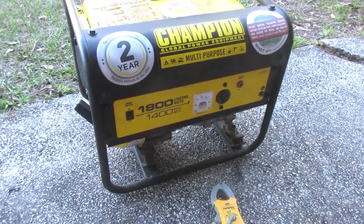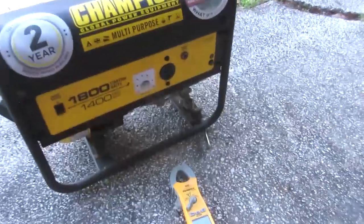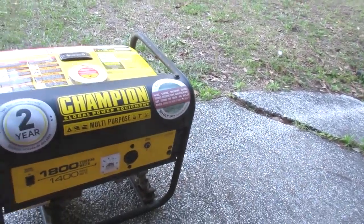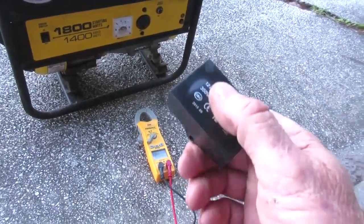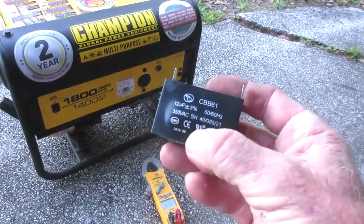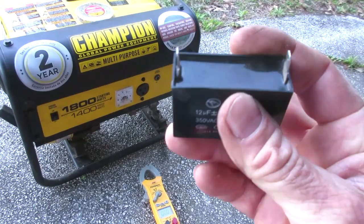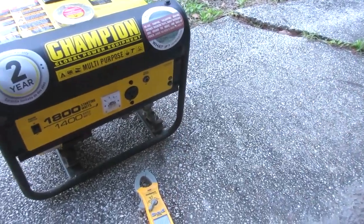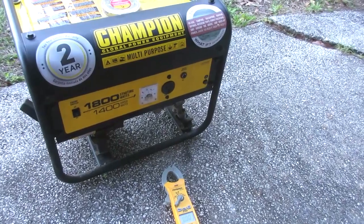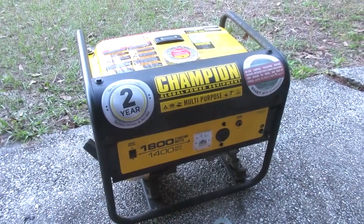That was an easy fix! This is what happens when you use your generator and store a bunch of stuff on it when you go away — all your parts fall off. Anyway, the end result: swollen capacitor. If you don't have a multimeter to check it, if you see something like that, swollen out on both sides, chances are it's dead. They have a tendency to pop out like that. Turned out to be a piece of cake — a cheap fix, 10 bucks or something, and we're back in business. Nice little generator.